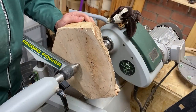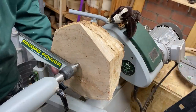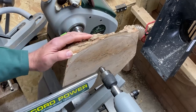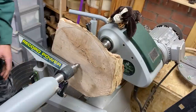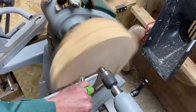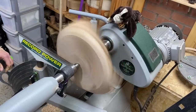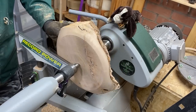When you're dealing with a wood like this which has an awful lot of unknowns, you've got to try and keep yourself as safe as possible. Luckily I can move my control box over here. Everything I do on this bowl will be done from well to the side of it. We're going to be starting off at around 600 RPM, everything's locked down nice and tight, and we'll see how we get on.